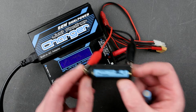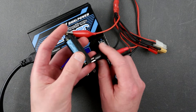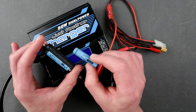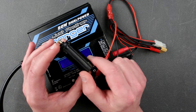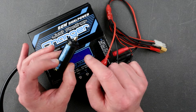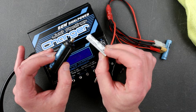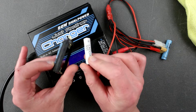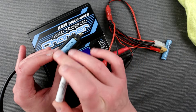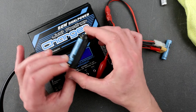I MacGyver'd a battery compartment here from an older flashlight. As you can see, this 10440 battery is exactly the same size as a triple-A, so it fits nicely. However, using one 10440 here would be a bit silly — it's only 300mAh, whereas three AAA batteries together would give 900mAh and work way longer. You'd also need to sort out the voltage mismatch.